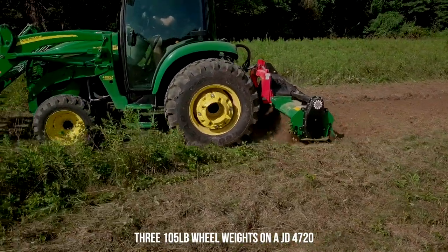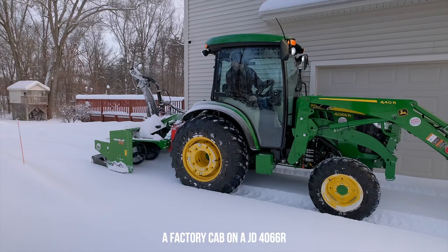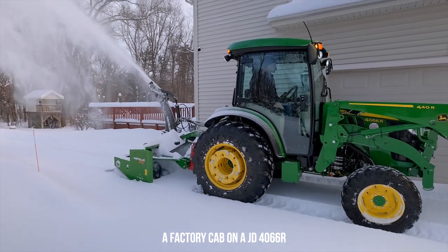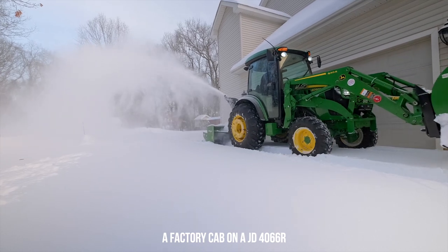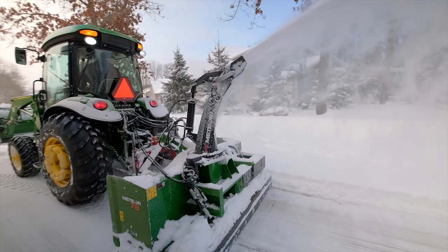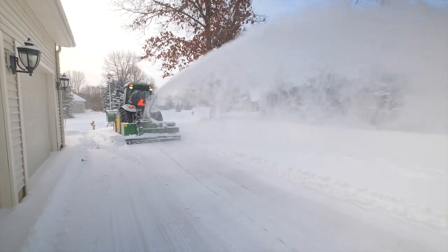But if you're in a cold climate, when you're pushing snow, you want to have something like Rim Guard, beet juice, washer fluid. A TL90 is what we use here locally at Meekhoff Tire, Mattawan. But one of those liquids that's not going to freeze up and corrode over time is what you want. So if you're thinking about adding on an aftermarket cab to get out of the cold in the wintertime, a really good additional benefit besides keeping you out of the snow and the blowing wind could be the additional ballast weight. Most of that is going to sit over your rear axle and really help get more weight right over that axle to get to those tires and keep the traction going.